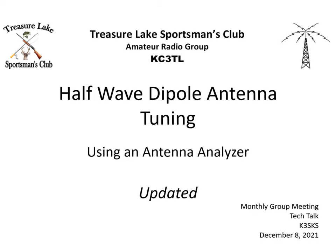We'll go ahead and get started. What we're going to do is take a look at one way that you can adjust a dipole antenna using an antenna analyzer to get your resonant frequency of the dipole right where you want it, depending on what your intention is for using the antenna. There might be other ways to do it, but this has worked pretty well for me, so I thought I'd share it with you.